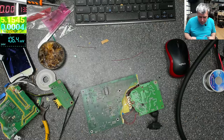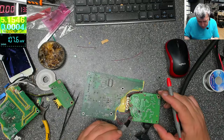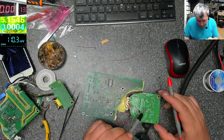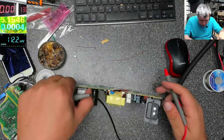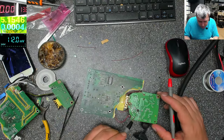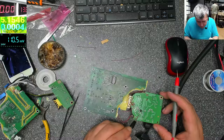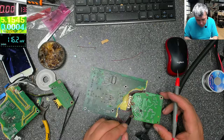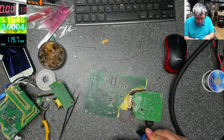How is this power supply starting? Should have like a cold start. Probably some resistor. So it's getting from the IC here. A resistor, another resistor here, and another resistor here. A diode, sorry, here it's a diode. And from here, it's another diode. So that's the pin which the chip is starting. So I have a voltage from here, from the AC, and one from the transformer. It's a simple, beautiful power supply.